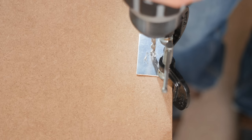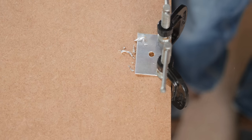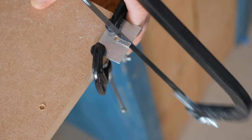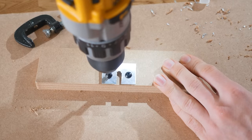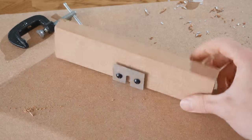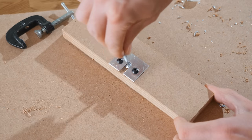Whilst we're cutting things out, it's a good time to make a bracket for the mirror to hang off the wall. To do this, I drilled a small hole in a piece of aluminium, and then cut to it with a hacksaw to make a slot. This could then be screwed to a block of MDF, utilising some washers to push it away from the block's surface, which allows room for the head of a screw so that it can slide up in place.